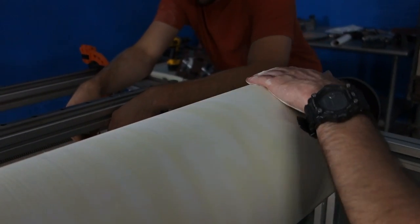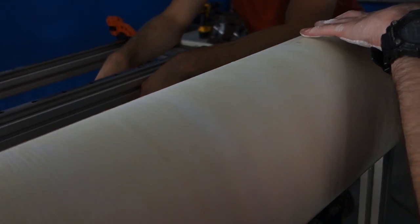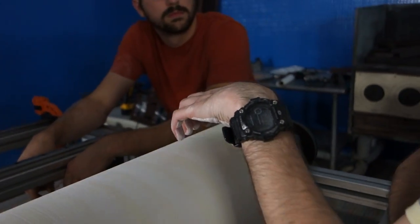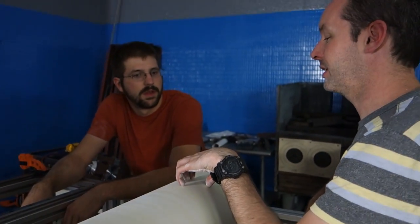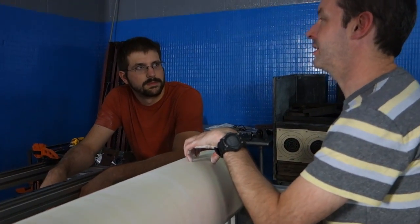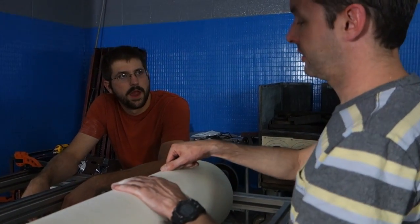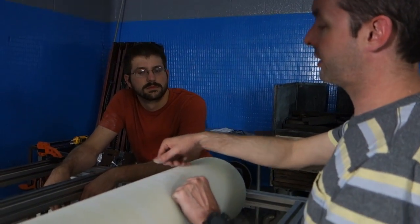Well, we did the first coat, we got into a wind, and then we had to stop for the board meeting. So we come back, it's 2 hours later, and it's not dry. Oh, it's got to be tacky and soft. And it was really, really bad. Like, it gummed up. So we tried to continue the wind, but there wasn't enough lubricity to it to be able to move and keep the windings closed. So we ended up having to scrap the wind.